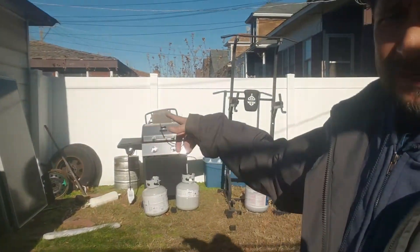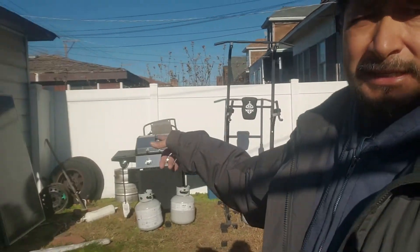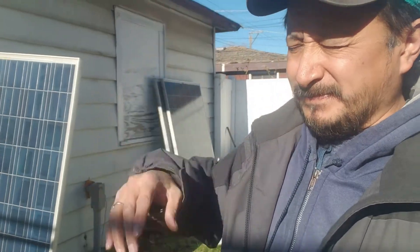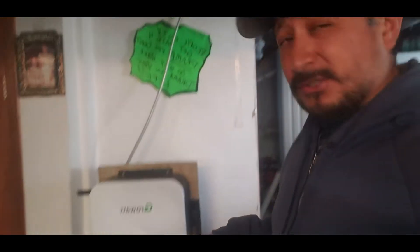I'm doing my whole solar array right there in front of the fence. I also have to start looping my batteries — we'll talk kilowatt hours in the next video. Everything's good: four panels hooked up, battery maintained at 55 volts. My fish tanks are pulling 103 watts right now, and the four panels should be bringing in almost 1,600 watts. My battery is staying charged, which means I am running solely off solar right now for that load.